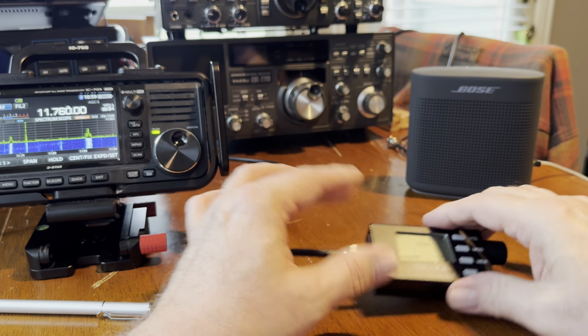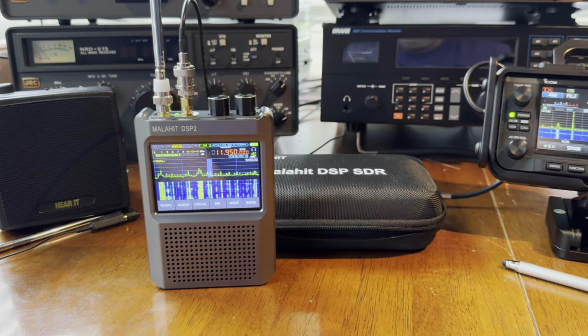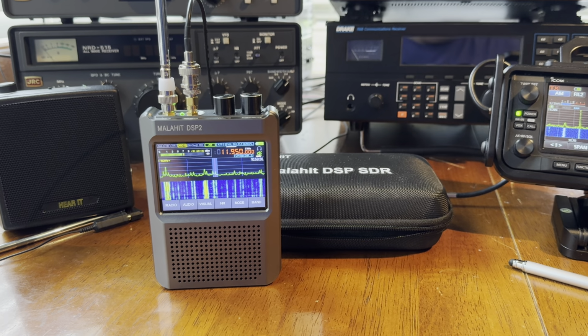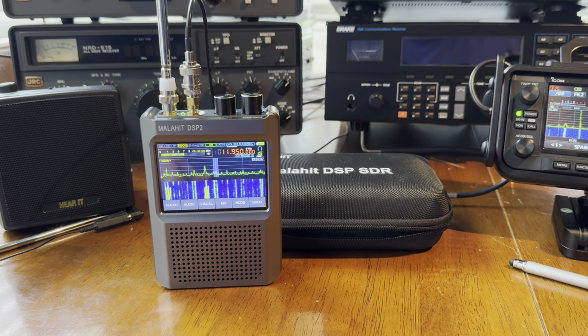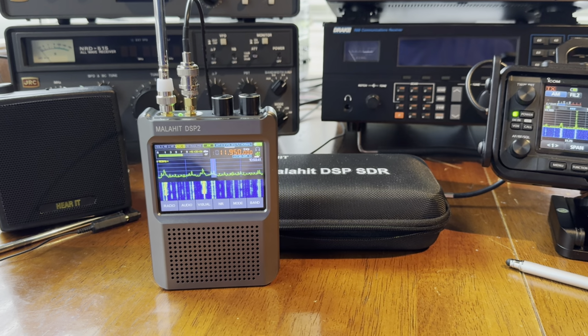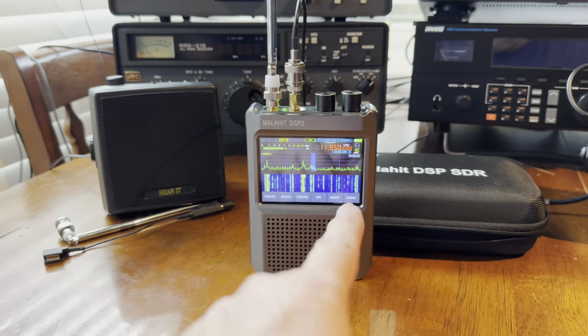All right. So, up in the 15 megahertz range, man, all three of these radios were like champions. And it's like, all right, which one costs the least and which one has the nicest spectrum scope, and then do whatever's important to you. All of a sudden now you tune down to 12 megahertz or 11 megahertz, and it's like, what the hell's going on with this radio?